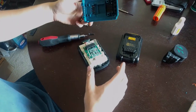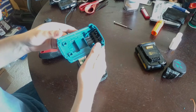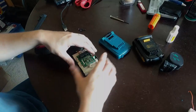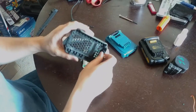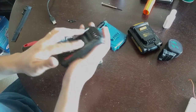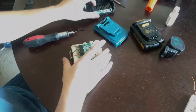Last screw out here, open her up. The construction of it is a PA6 glass fiber reinforced 15%. So it's pretty stiff. It's what you find on all your tools, DeWALT tools, Milwaukee, everybody's using the same exact plastics. Same as the bottom, it's a glass fiber reinforced 15%. And it actually has kind of a TPU overmolding here, so it's a nice little rubberized coating on the bottom.